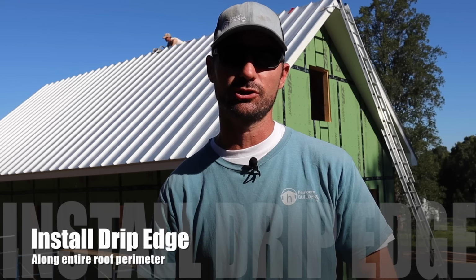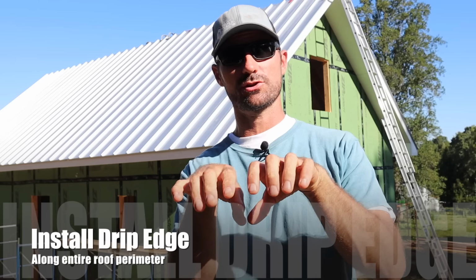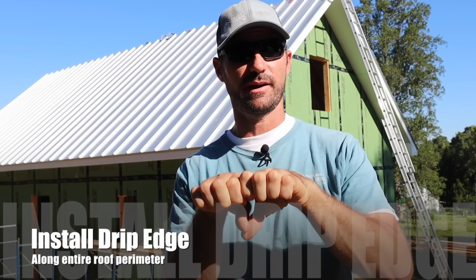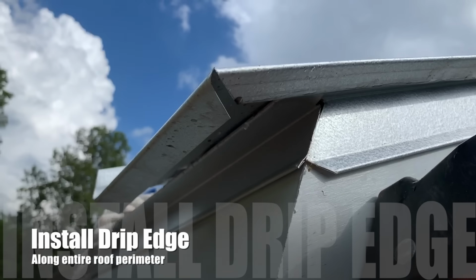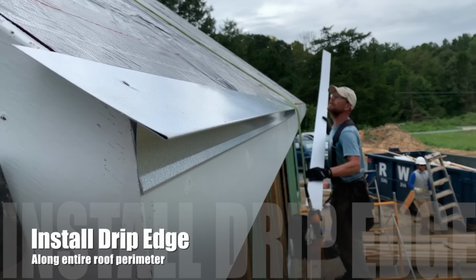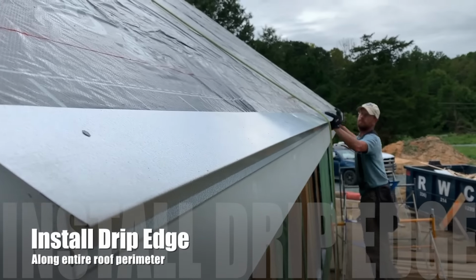All right, so step 3, installing drip edge flashing. In the case of standing seam metal roofing, the drip edge serves as a cleat to hold the bottom edge of your roof panel so that wind doesn't pick it up and blow it off. And it creates a waterproof transition from your metal panel straight into your gutter. So it's really important to either tuck that drip edge underneath your underlayment, or if you have to, like we do here, tape the drip edge to your roof underlayment. Nail or screw the drip edge flashing every 8 inches in a staggered pattern, and just make sure that it goes into your sub-fascia wood framing.